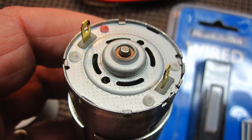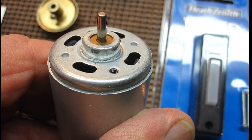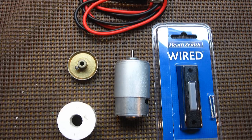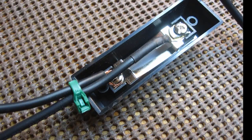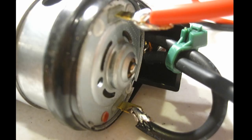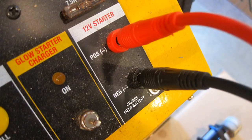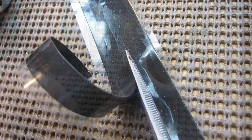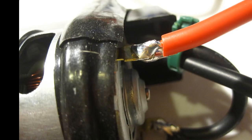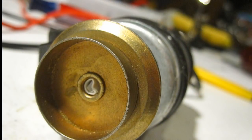First of all, I used a 12-volt electric motor I got on eBay from Mops Electric. It's a 550-class motor with high torque and 13,500 RPM, with 61 watts power at 7 amp. Next I purchased a doorbell button from Ace Hardware and mounted wires to it. Since the motor needs to run backwards from what is marked plus and negative on the motor itself, I connected a negative wire through the switch to the terminal marked red or plus. The plus wire then connects directly to the negative terminal, and the banana plugs on the end connect easily to my power box. I then used zip ties to connect the switch to the motor, extending it out the back to protect the motor terminals.